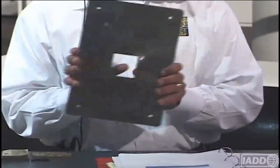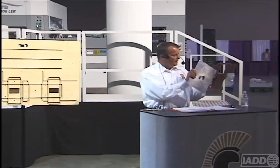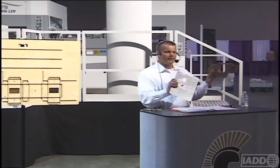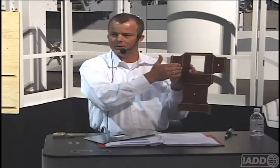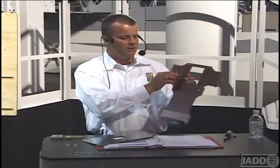The reason steel has a benefit compared to phenolic is because if we want the die to be embedded within the window here, the score needs to have a support wall. If you get too close, that minimizes the support wall where the score comes down into the cavity on your scoring counters. Eventually, over time, the phenolic score counter will have a tendency to break down a real thin support wall.